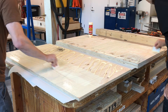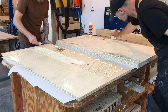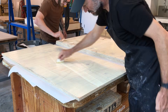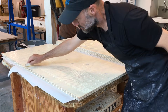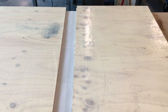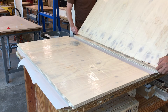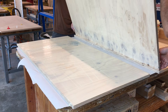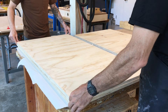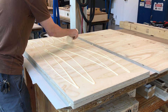In the video you can see both sides with a thin and even coat of glue. For each square foot of surface to be glued you will need one ounce of glue. In this case we joined three layers of plywood which has two glue seams. Each plywood piece is two foot by four foot, or eight square feet, and there are four plywood faces that will get glue. That totals four faces at eight square feet each, equaling 32 square feet, and we used about 32 ounces of original Titebond glue.